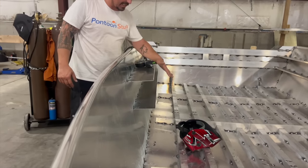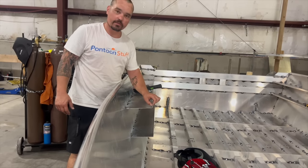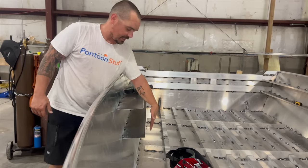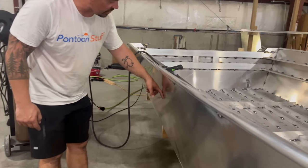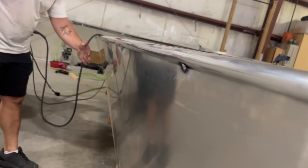So we use these tackle trays. This is an 8.5 inch with a 1 inch lip. We'll put some trim on top, and a 6.5 inch. So they end up pretty close to in line. The bottom sticks out a little bit, which will actually make it easier to get your rods in and out of. But if you look at the sidewall, it really shored this up nicely to make sure that we don't get any heat warp as I weld.